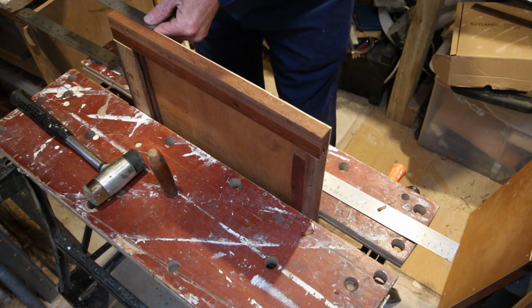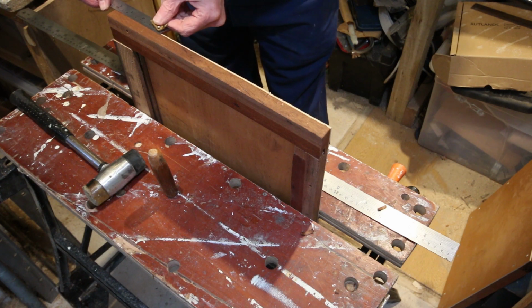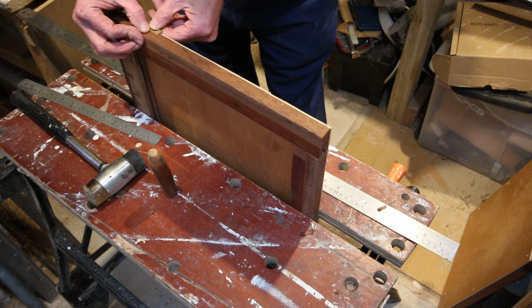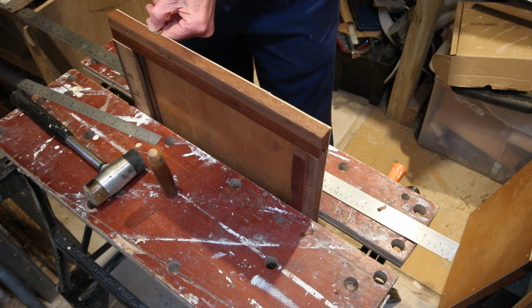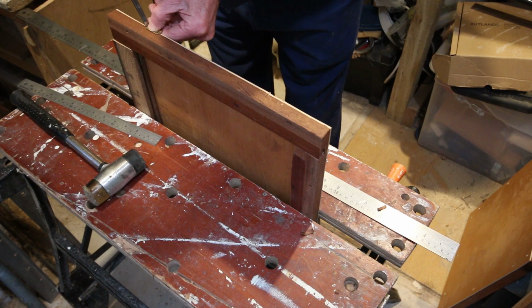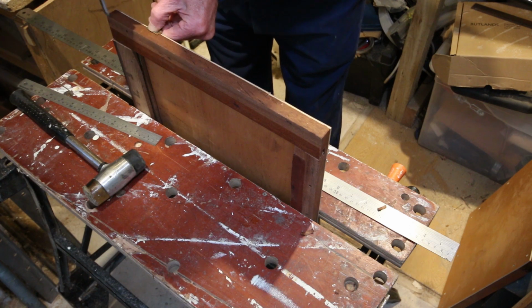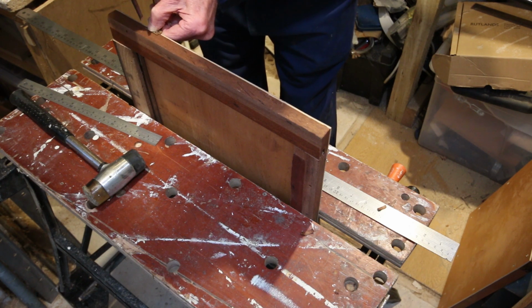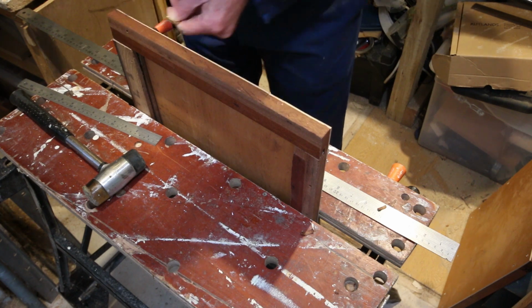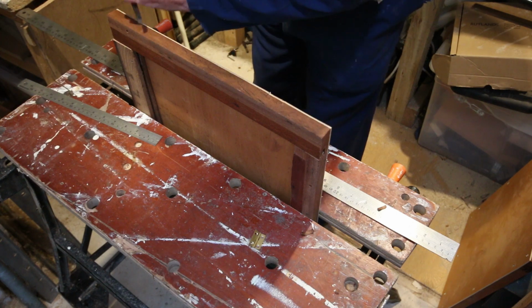So I'm putting them about 100mm from the top edge and bottom edge, and I had thought I will just leave them sticking proud, but now on second thought I will inset them. So thankfully I have nice sharp chisels, thanks to my neighbour Tim. He did me the great service a few months back of sharpening all of the chisels. They were in a deplorable state.